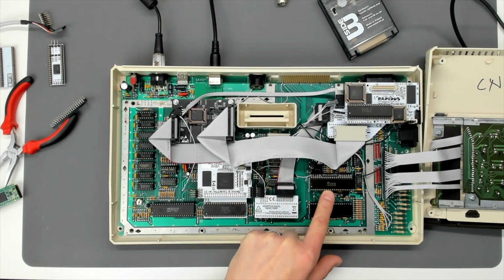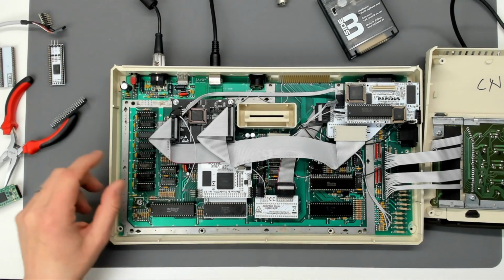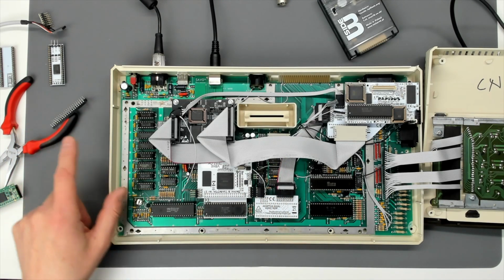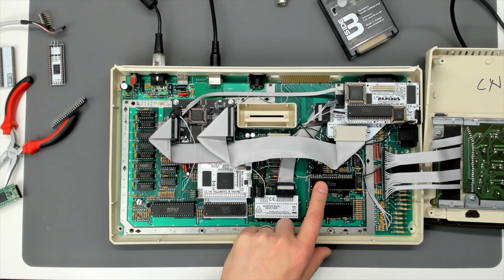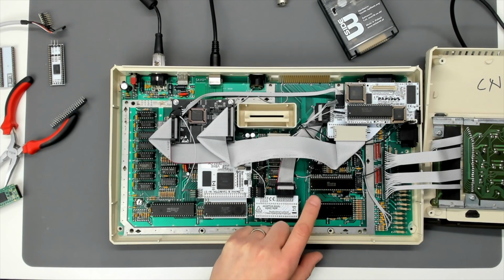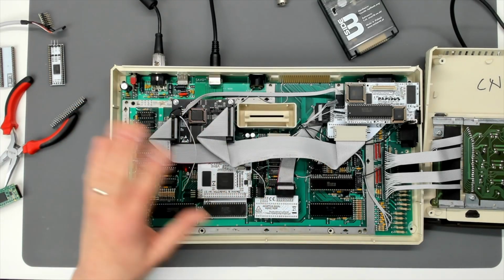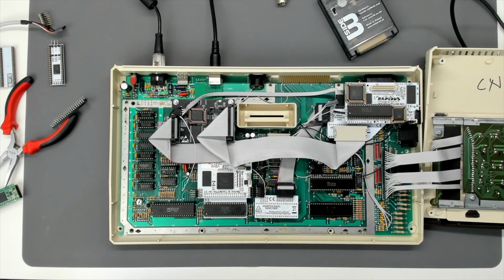So now I've got two of these new boards, thinking that this would solve the problem. And I would have given one of these boards, I mean, I got them for free anyway, to the customer in lieu of the original one that I bought on his behalf. But there still isn't a fix for this. Actually, Candle did send me a firmware update that he wanted me to try, and I did flash it, and it actually kills the board. I mean, not permanently kills it, but it bricks the board. Nothing runs. You get no num-lock light or anything at all. So where I got the idea that this would be the end of the story, I just do not know.